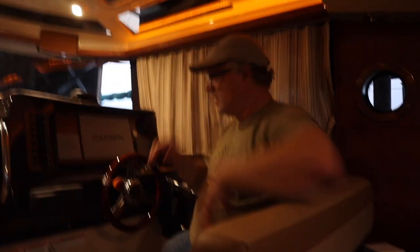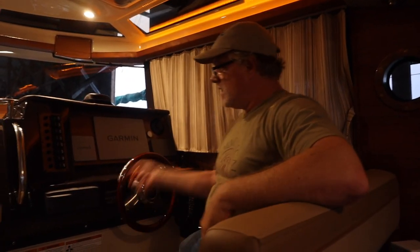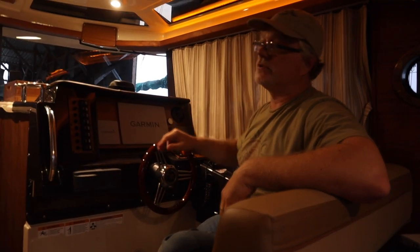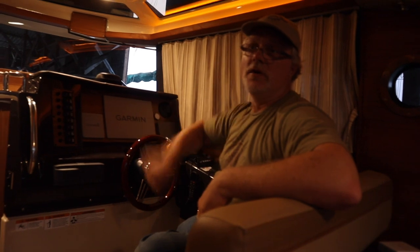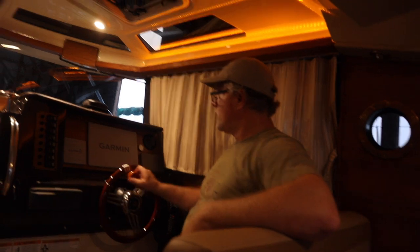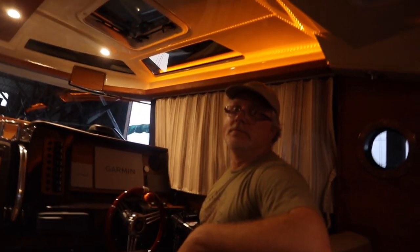I go about halfway down the dock between slips, take it all the way hard to port, put it into reverse, tap the bow thruster to starboard, and the boat starts spinning around its center point. Then I alternate — tap forward, tap bow thruster to starboard — working it back and forth. Usually takes four or five alternations to do a 180-degree turnaround. Then coming back up the channel puts my nose into the wind and I make a left turn into the slip. The suicide knob is also handy for regular driving. Thanks for watching — subscribe for notifications, like and subscribe, and check us out on Facebook at Channel Surfing. See you next time!